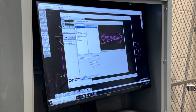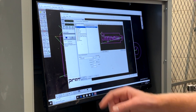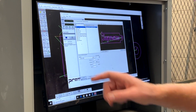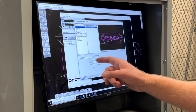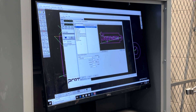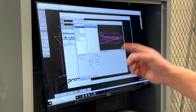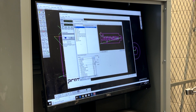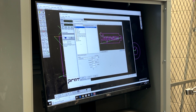Once we open up the red file, we have the piece, the thickness, tool offset, rotation, and scale. We will not be changing the tool offset, but we will be changing the piece material and the thickness. We measured it at an eighth of an inch on the calipers, so we'll set it to at least that, maybe a little more. It's steel, so we'll go with mild steel — Mild Steel A36. Scale is at one because we had this cut to precision. Then press okay.